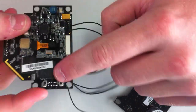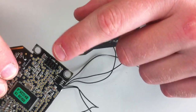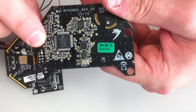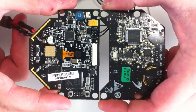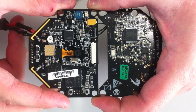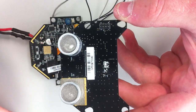Soldering to the tops of these boards is fairly easy for the 5-volt pins. I've actually not soldered onto the bottom connector here because I didn't want a lot of wires hanging off the top of this board. Instead I've picked up the 5V on the ultrasonic board itself. I identified that this pin is the 5-volt high pin, which aligns to the pin on the top of the main board as well. With a little probing I found a 3.3-volt and a 5-volt pin. Be careful with the 3.3-volt pin — I had trouble getting a constant signal through, as it seems to turn off and on, likely from the drone communicating with sensors.